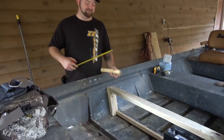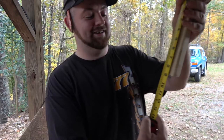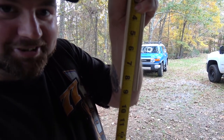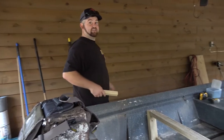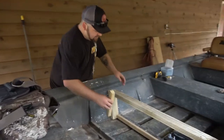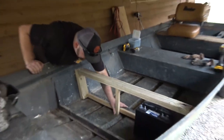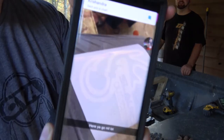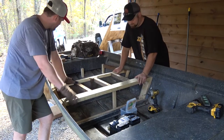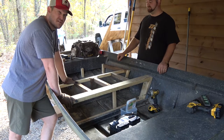All right, Houston, we have a problem — let's go ahead and measure this. It's supposed to be nine and three quarters. Does that look like nine and three quarters to y'all? The answer is no. All right, now that we actually cut it to nine and three quarters — now I got it angled. Look at that, that's a party snug right there. We got the platform cut and all our bracing for the most part done — the template's cut anyway. It's a rough fit, so we're going to try it out and see how it goes.